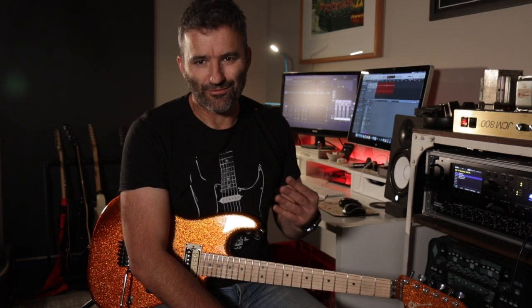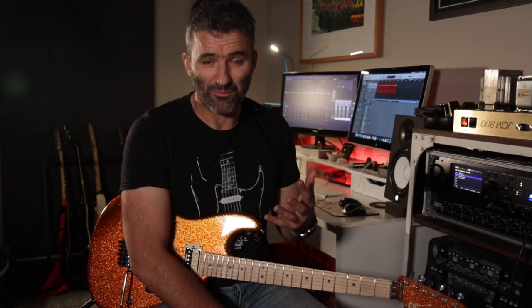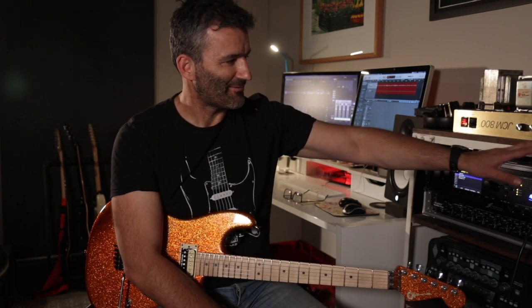So often you'll see in modern Jose style, modern Marshall, anything from the Cameron CCV, some of the Fortin stuff, even our own Kelly amp, of course, bright switches or selectable bright caps on the gain stages. And the fact that this old 800 already had that, I kept it because it's a useful addition. You take some of the high-end aggression out of the amp.